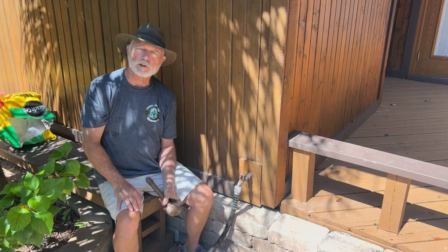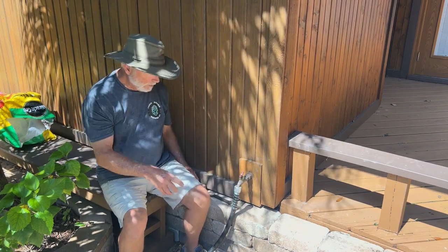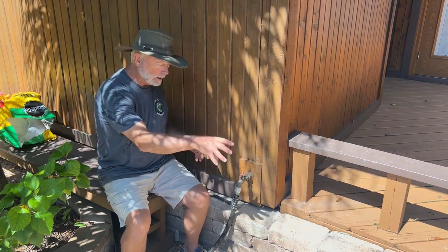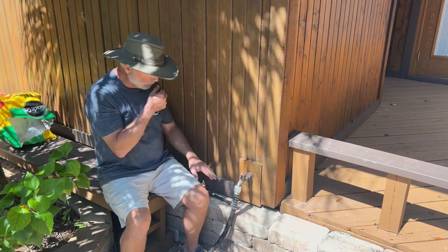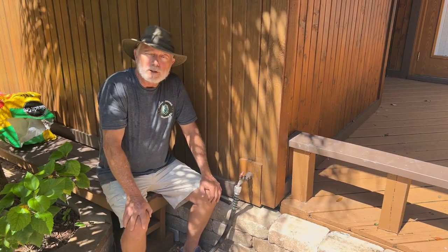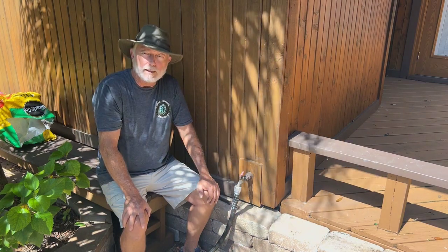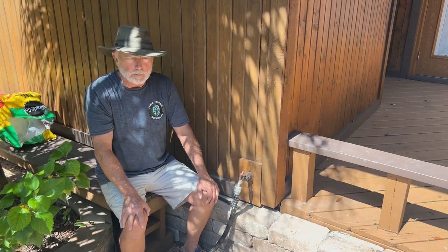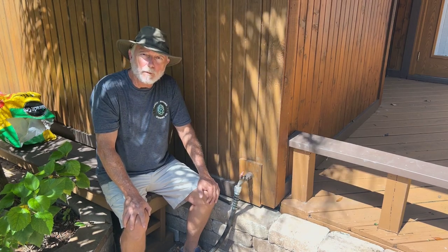That's what I did — using a chisel and an engineer's hammer to bust them loose. These are all held down by construction glue, so it took a minimal amount of effort to get those out. A big row of those came out, then I took out the three pavers underneath that were butted right up against the wall. Then I was left with a four-inch thick concrete slab, which paid absolutely no attention at all to being hit really hard with a sledgehammer. That meant I had to get creative.